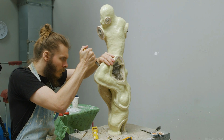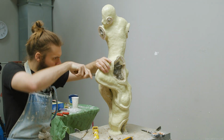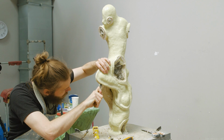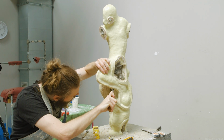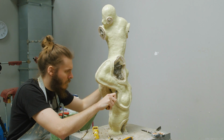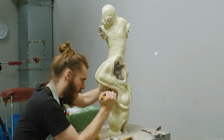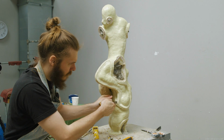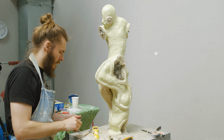When the model mold is safely removed, we move on to removing the silicone. The silicone is made in one piece with a wall signifying where it is supposed to become parts, as compared to the model mold, which we make in two parts to begin with. This means that to remove the silicone, we must first turn it into two pieces, and we do this by cutting down the middle of our silicone walls, which has been strategically placed so that the silicone pieces will come off easily, once cut that is. And of course, we place them with the model mold coming off in mind as well.